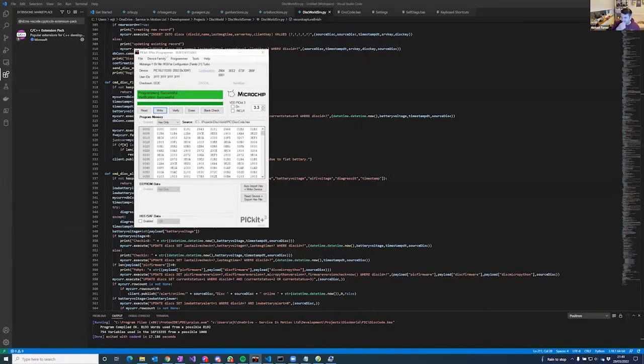So this is the PIC Kit 3 Plus programmer. This, again, you have to pay about 15 quid for the bit of software. But what it will do is you can get it to provide power. I've unplugged it, so it's not going to work. But if I tick the on button, it will actually provide 3-volt power, or whatever I've picked in this little setting here. It will provide that power to the PCB.